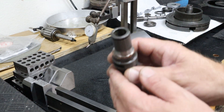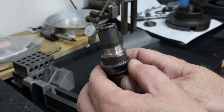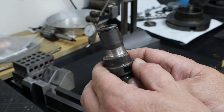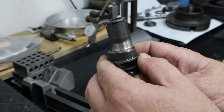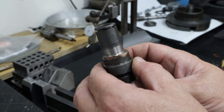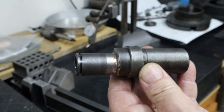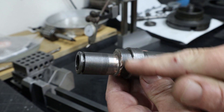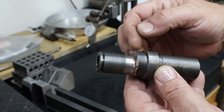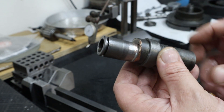The next big issue was with this piece. We knew it had been dropped, and I ended up using silicon bronze to weld it back together - it was partial braze, partial weld, as some of the cast iron actually flowed in there. This was extremely hard to turn; I couldn't turn it with high-speed steel, carbide wouldn't touch it, so I mounted it in the grinder. I also ground this area with a taper of about 5 degrees going back, so that when the other piece tightens up it has something to grip and pull it in, as when left flat it kept wanting to move away off the hardened piece and squish into the softer material.